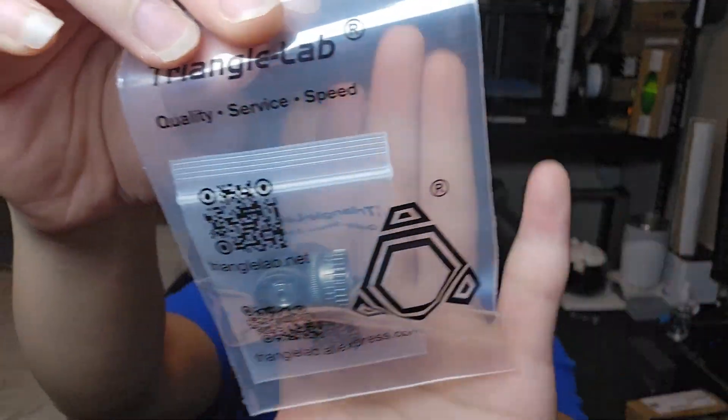This is for the K2 Plus. The extruder gear on the K2 Plus is advertised as plastic, so I got these metal extruder gears from Triangle Lab — they're supposed to be much more durable. The reason I got this is that the K2 Plus cannot print TPU flexible filament. I tried and it really can't — the tension feels way too rough.